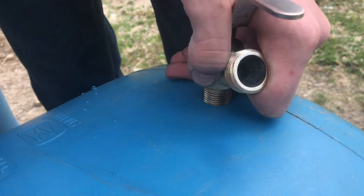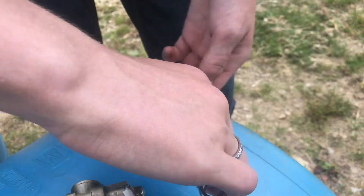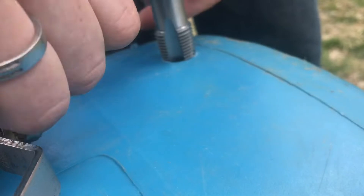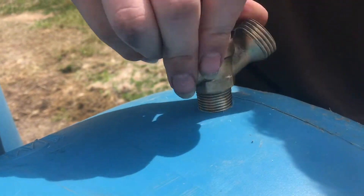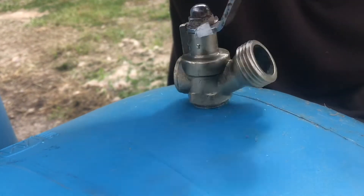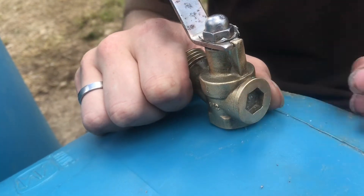You can always go farther, but if you cut too far up there's a lot less taper, so at this point I'm going to stop and see how well our fit is. This is just a little bit too tight, so that means we need to go a little bit deeper with the tap. You can always remove more material but you can't really put any back on. Now the hole is getting a little bit larger — we'll stop about right here and double check our fit. Now this fits in here just right. It threads in, first it starts loose, and then once we get to the end it snugs up on that taper, and that's what we want to feel — nice and tight, and that's going to hold water.